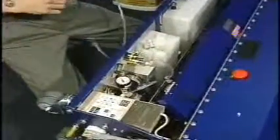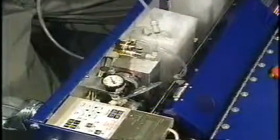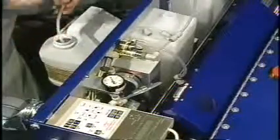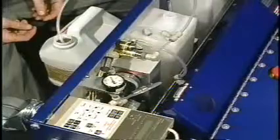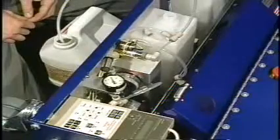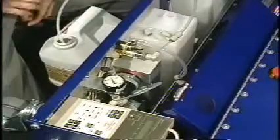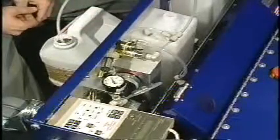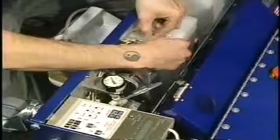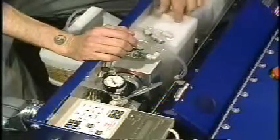We'd then take a piece of 1/4-inch hose out of our accessory kit and plug it into that fitting and run that hose into a jug for waste or used oil. At that point, we would access our pump from our test output menu, and we'd turn on that output and allow those lines to flush out so we got all the old oil out of any of the lines in the lane machine. Once we flushed it out, we would remove this hose, plug it back into our return line, and we should be able to go out and oil lanes.